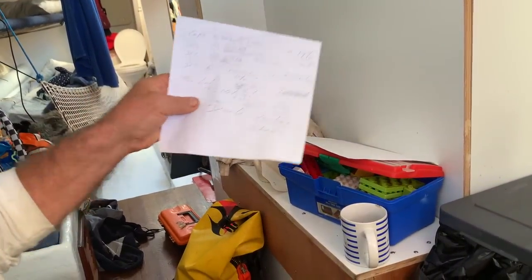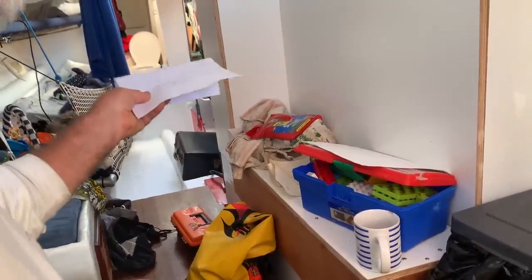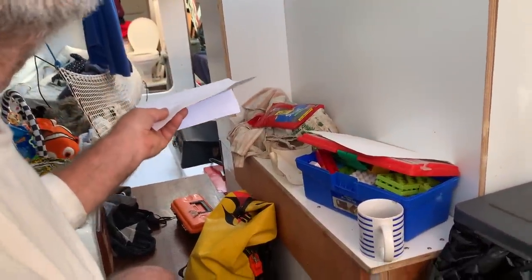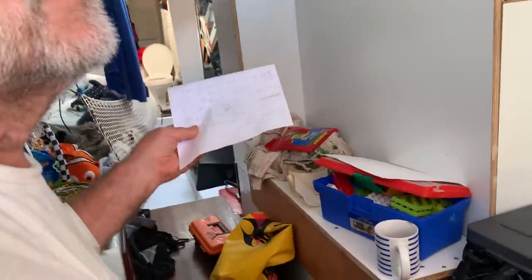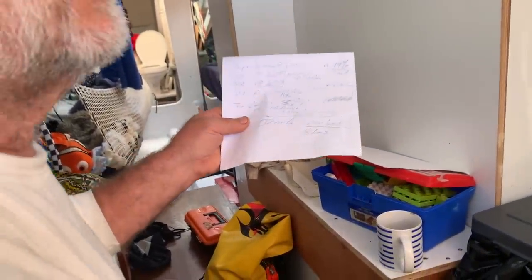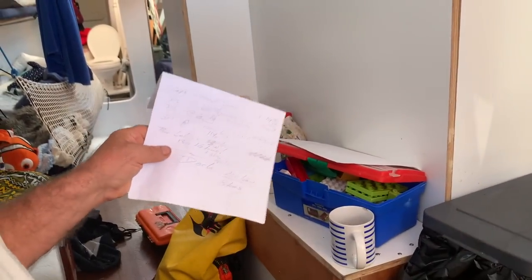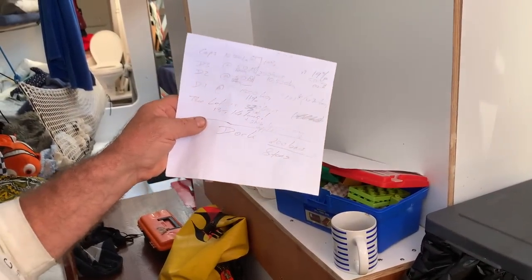Okay, so relieving 6 tons is just a smart thing to do in the dock when you're not using the boat. And if we were to sail without that shim? You probably won't lose the mast, but because of the D1s being so slack, the mast is going to be all over the place, so it'll be looking very ugly.